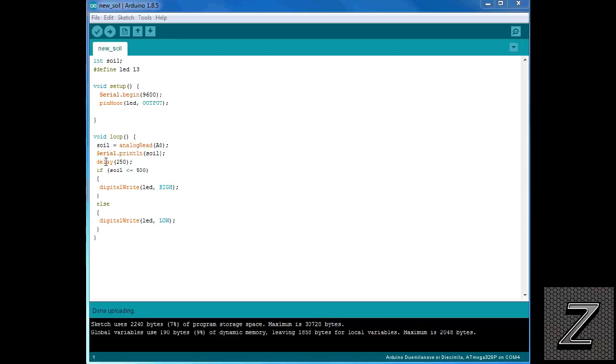Then I'm doing a delay, because you don't really need this thing reading like every millisecond. And I did a 250. I would actually probably recommend putting something in here bigger, like just do a reading every minute or maybe every 10 minutes. You don't really need to check it super often.